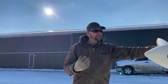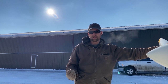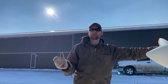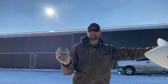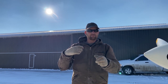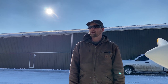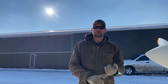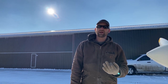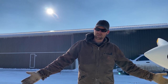As you're ready to do your run-up, be prepared to have to do it on the move, right? So you're ready to bring your RPM in, then all that stuff we normally go through once we're sitting in the airplane, we'll go through that run-up process. Big thing is, of course, just make sure it's clear of ice, we do a mixture check, and then check our mags. And we're basically ready to go. Remembering we can never stop, right?